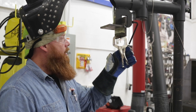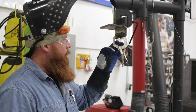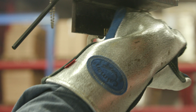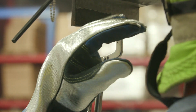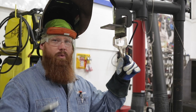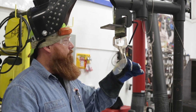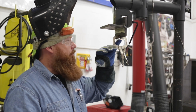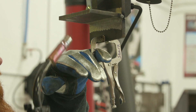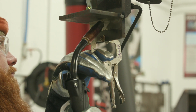Before we weld, I want to show you a cool trick I've actually done out in the field and in a shop. The biggest rule of welding is always be comfortable. One of the things I want younger people to understand — you always want to be comfortable when you're welding. So take a small clamp and put it below the piece you're going to work on. Basically I'm just going to put my pinky right through here and I'll be able to hold my gun and maintain a proper contact tip to work distance — recommended three quarters of an inch to one inch with this specific wire.